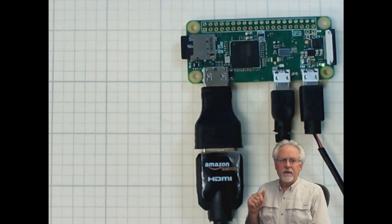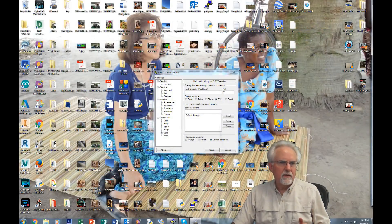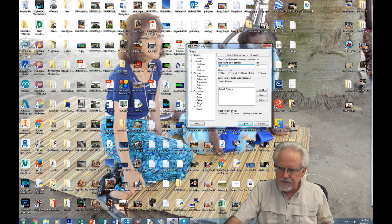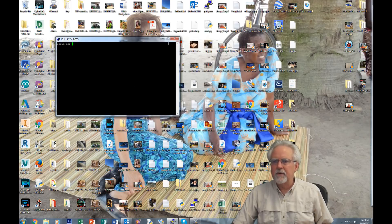So now we have the Raspberry Pi Model Zero booted, we have got the Wi-Fi turned on, and we've got a Wi-Fi connection to it. Now what we want to do is see if we can connect remotely to this, so I will bring up my PuTTY. PuTTY is very easy to download — if you don't have it, just Google 'download PuTTY.' So I'm going to come over here and enter 10.1.15.37, which is the IP address that we just figured out. It hasn't seen this device before, so it's giving me a warning — I'm okay with this, I trust this device.